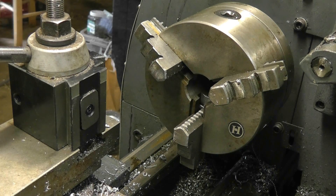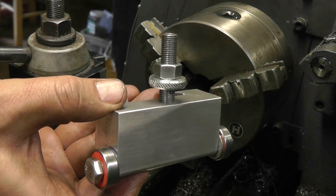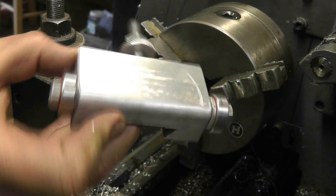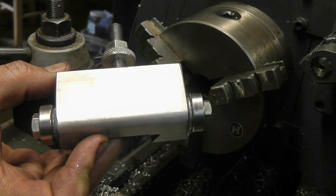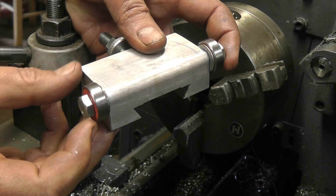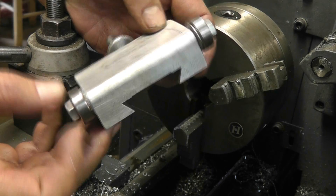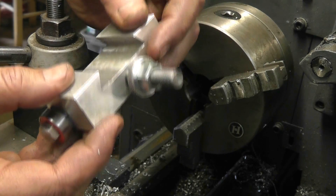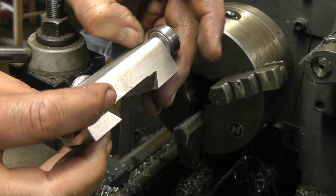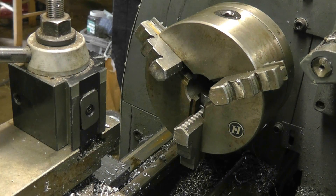After a whole bunch of fast-forwarded video, there's the completed tool with the just-made knurled nut. There it is with the bearings installed — these are roller skate bearings held in with 5/16 bolts, or you could use 8 millimeters which is what it's supposed to be, but 5/16 is close enough. There's a little bit of sanding on it and some marking remaining, but hey, who cares.